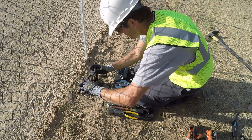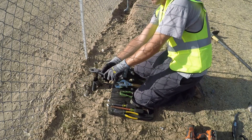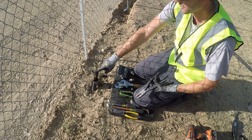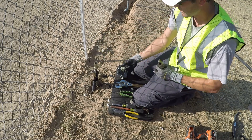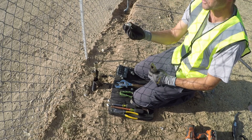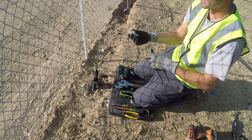For these connectors, you're going to cut halfway in, turn it 90 degrees, and then cut it all the way — that gives you a diamond cut on the end of your center conductor. If you just cut it in one direction, it can mushroom out the sides, and when it goes up inside the top of the pin connector it may not seat properly if it's distorted on two sides. If you do a diamond cut, it should go in there nice and evenly.